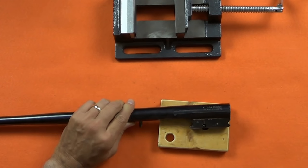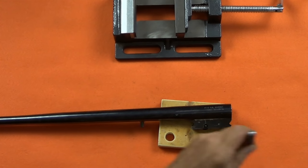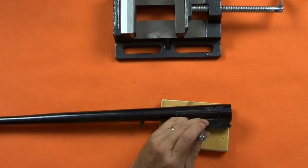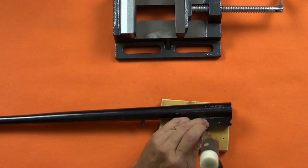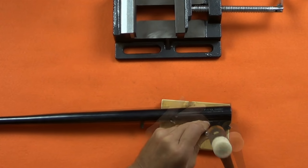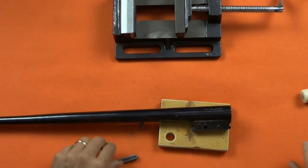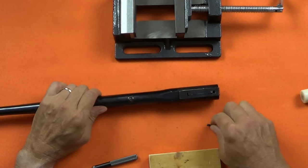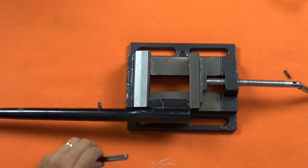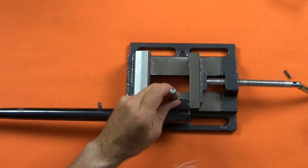The original issue with the gun was a broken ejector, and it's in the barrel group. Under the barrel, there are two pins. The front pin is the ejector latch pin. It's not under any kind of spring pressure, so it can be easily removed first. The back pin is the ejector stop pin, and it's holding the very strong ejector spring.